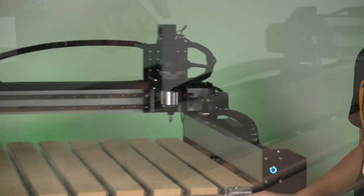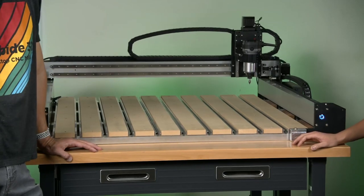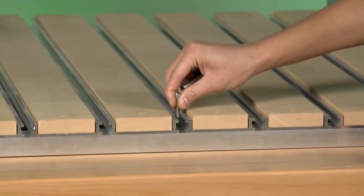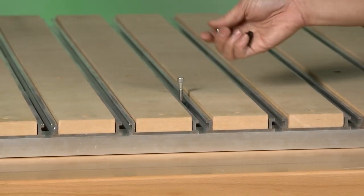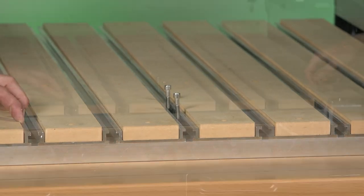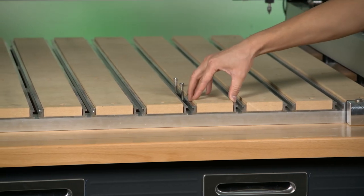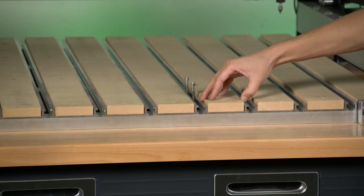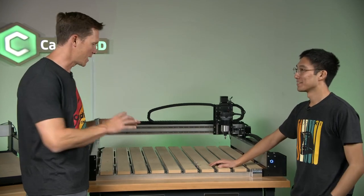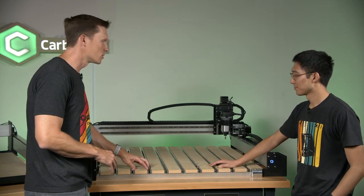In terms of obvious differences — the bed. This is one of our favorite innovations. We call it the hybrid table. We thought we'd give people the best of both worlds: you have integrated T-slots and MDF. You can screw parts into this table, you can use T-slots and clamps. It gives you infinite flexibility for how you hold your parts on the Shapeoko Pro. Each one of these strips is approximately three inches — about 75 millimeters in width. I love that it's three inches apart. I personally have the T-slot bed for the XXL standard Shapeoko 3, but this one is so much narrower — you get so many more options.